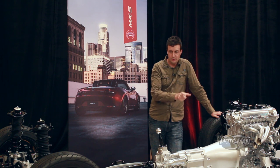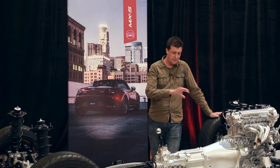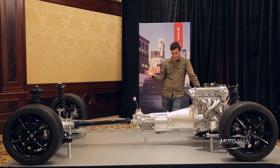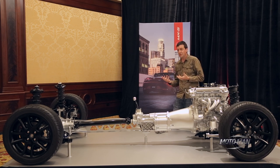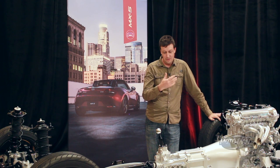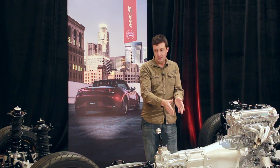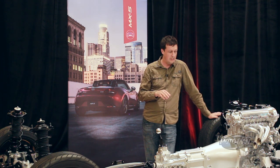This six-speed has an unusual gear set — extremely short gearing with a sixth gear that's one-to-one. Typically a rear-drive transmission has a fourth or fifth gear at one-to-one and then the top gear in overdrive. But the one-to-one gear is the most efficient gear in the transmission because you're directly hooking the input shaft and output shaft together without sending torque through any gears. So that's the gear you should be using when cruising on the freeway for fuel economy. We built this with a one-to-one sixth gear and made the final drive much taller so total gearing is about 10% taller than the NC.